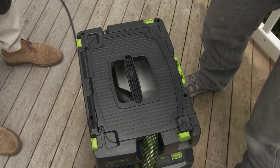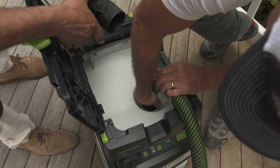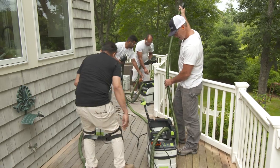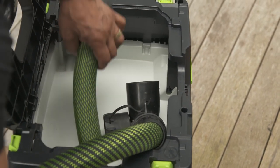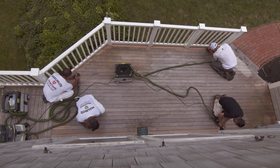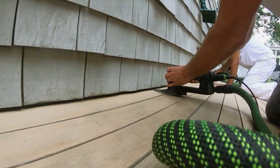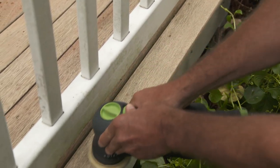We've got four sanders but only three vacuums. Let's open this up and I'll show you how we're going to share this vacuum. I've got a Y connector here — remove that hose, put the Y connector right in there, put a hose right there. I'm going to take my hose out of this vacuum and join it right there. Both connected — I think we should be ready to go.